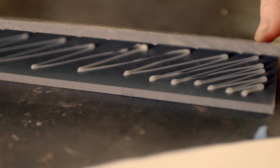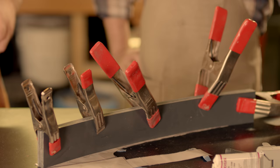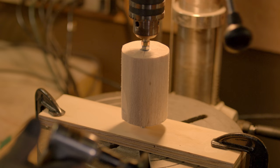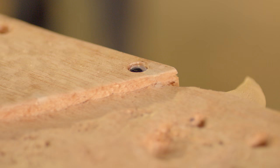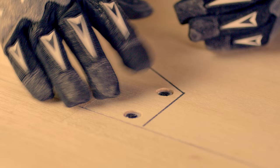We're gluing these sheets of mechanical PVC together and then bending them to shape with a heat gun. We're going to do the drill press lathe thing — there's no regular lathe because we don't have one. We've taken a chunk of balsa wood with a hole running down the center and two sets of nuts and washers keeping it tight. We're going to use the same rotary tool — instead of pushing into it quickly, you have to go in real slow and feather it in. Then you can use a piece of sandpaper. Here's our pommel — I think it looks pretty rad. We're also using a cosplay trick by sticking plastic googly eyes in the shallow holes drilled with a Forstner bit. They look silly now, but once we paint over them, they'll look just like metal.